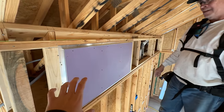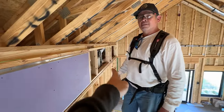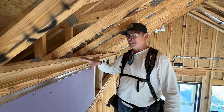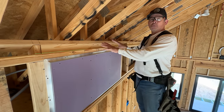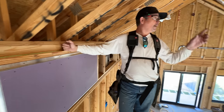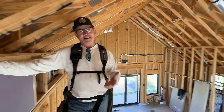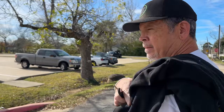This is a busy little area right here. You got 3 access panels, all the reveals, your plenum over there with the little slot diffuser, the LEDs here. It's busy. There is so much going on right here. But now you know why we had to make the drawing. Right. And why this wall almost had to be the last one we framed, because we had to figure out a lot of stuff. But now that we figured this wall out, it's time to head over there and do that one. But that one's gonna be a little different. Of course, why would it be the same? Let's hop off the scaffold, go hit it.